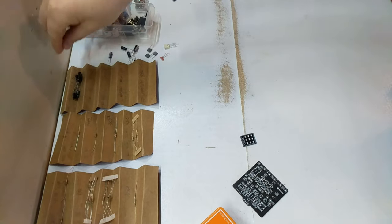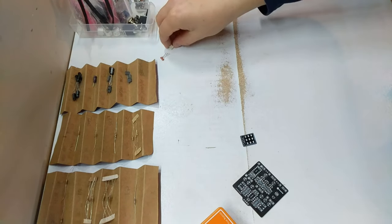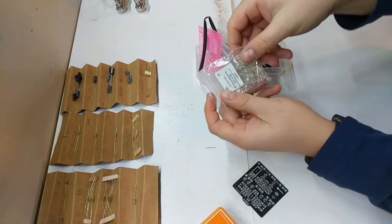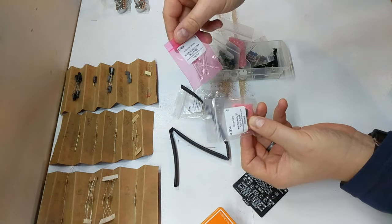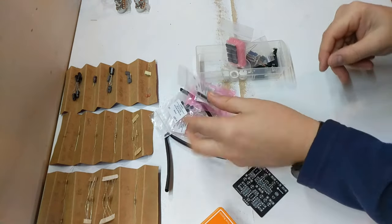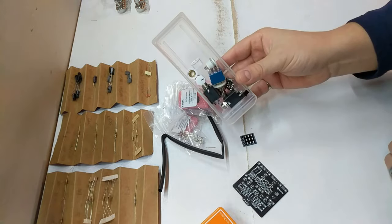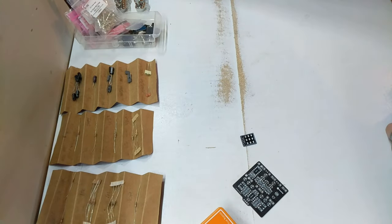I've got my capacitors here as well — if I just throw the capacitors on, you can see we should have room for all those. Along with the capacitors and resistors, just some other items we're going to need: some three-millimeter red diodes, some heat shrink (you'll see why we're using this in a bit), five-millimeter white diodes, an OPA2134 chip IC, some 2N5089 transistors, MPSA18 transistors, some LDRs or light-dependent resistors, and then a mishmash of other stuff — a three-pole double-throw switch, some audio jacks, some knobs, power supply, wire, edge cutters, screwdrivers, wire cutters.